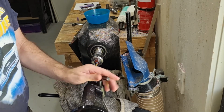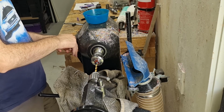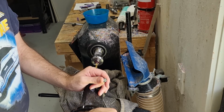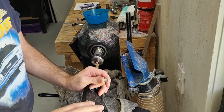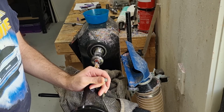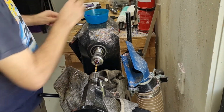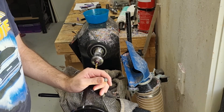So make sure it's all nicely lined up. Lathe speed to 175. Just be careful starting it because there's already part of a hole there, so it does have a tendency to suck the drill bit in and chip. So nice slow feed. Clear. And back and forth, and just until you get it all drilled out.